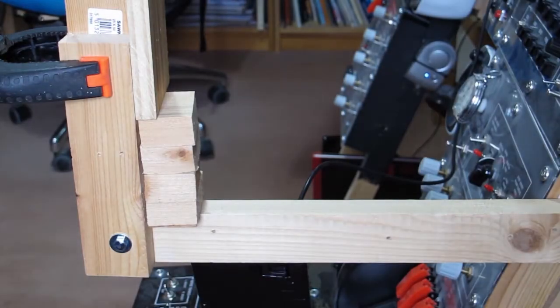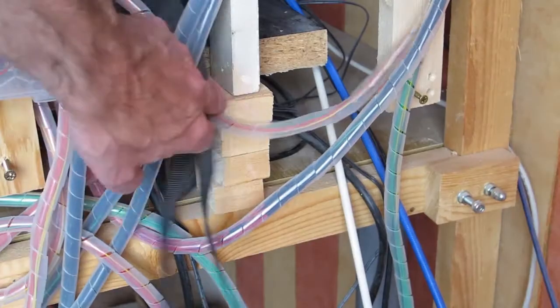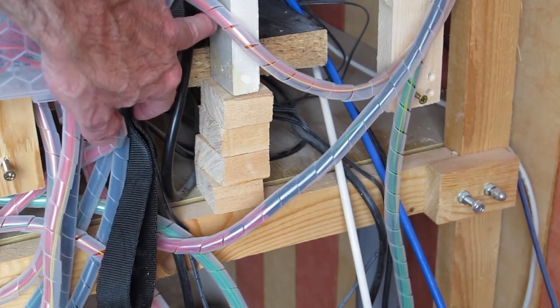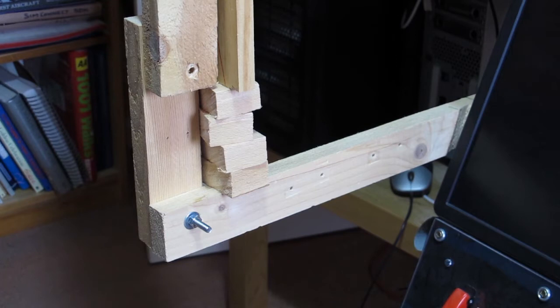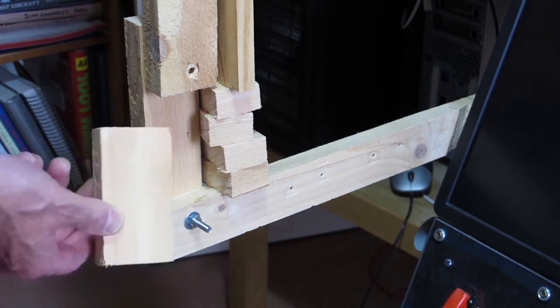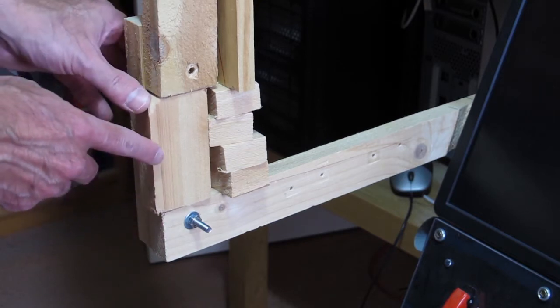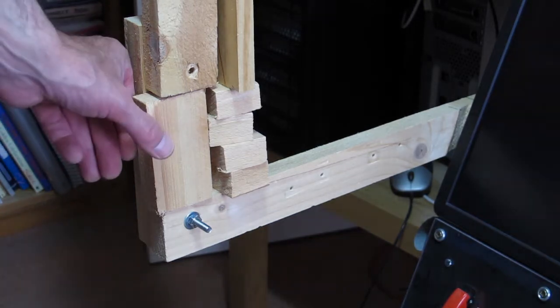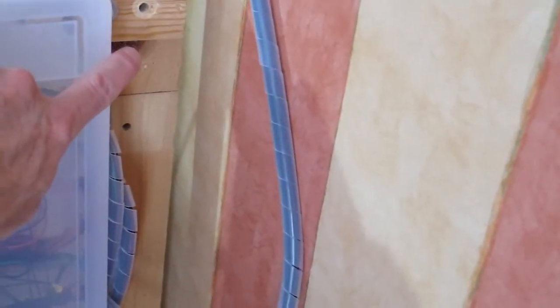We're at a crucial point — we've got the frame jacked up now by ten centimetres. You can see the wedges in there, a little bit more difficult to get in there on one side, so it's a little precarious at the moment. You can see on the inside of those joints there's now a space left for the ten-centimetre insert which is going to go in there. It'll be tidier once the wedges are out of the way, then we'll bolt everything back together.